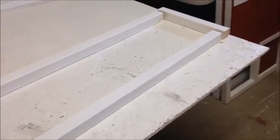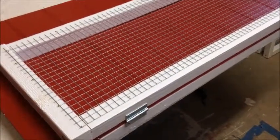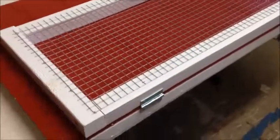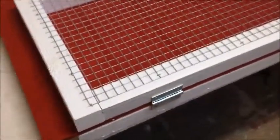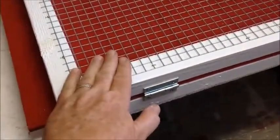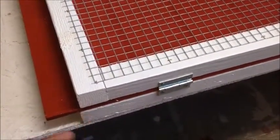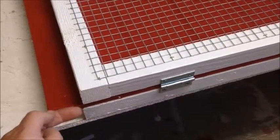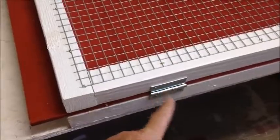Assemble the cleanout frame with two 12 inch pieces and two 36.75 inch pieces — you should make two of these. Once you've installed the screen on the cleanout frame, put it on top of the side that you made with the screen up and the side up. Make sure the upper piece sits just slightly inside the lower one, then go ahead and install the two hinges.